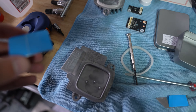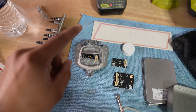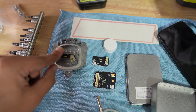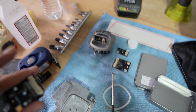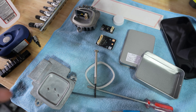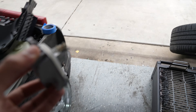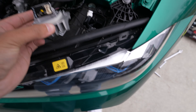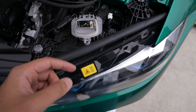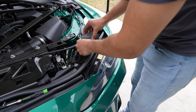I used a scotch-brite pad to clean up the heat sink surface from before, then rubbing alcohol to make sure it's nice and clean — did that on both modules. Now it's just a matter of removing the backing paper, sticking it on there, and letting it sit. I think they say four to five hours; I'm not sure if that applies to both the heat sink and the 3M tape version, but just to be safe I'm going to give it a few hours before reinstalling.